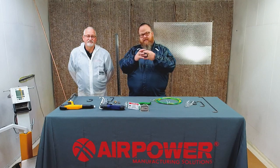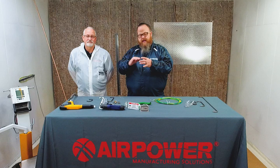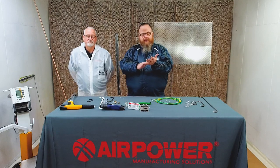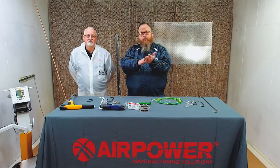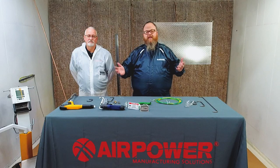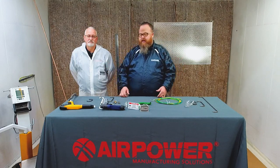And when that goes into the oven to cure, it never fully relaxes. That area is still rough. So when it comes out of the cure stage, you have a rough surface of powder that's now either pinholes, or a large cluster of pinholes, or a rough area like sandpaper that now has to be sanded down and recoated. More than likely, it's a part reject in your line.